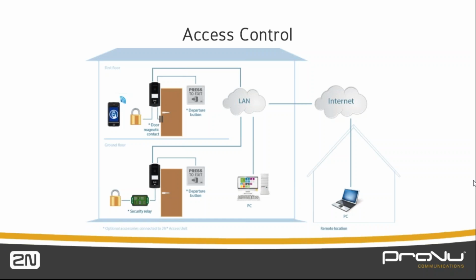Thank you very much. We've had a question as well. Do we have recommended settings for Cisco Call Manager? There is a page for that on the wiki. In the wiki section, there's a how to connect to third-party devices, and in there are the various Call Manager versions: 7, 8, 9, 10, 11, all the different versions. There are screenshots from the IP intercom as to what settings you need to set up, and then the screen settings from Cisco, and it gives you all of that information.